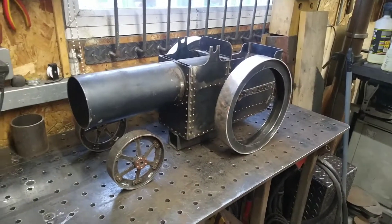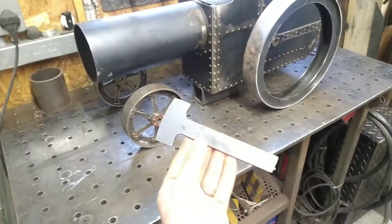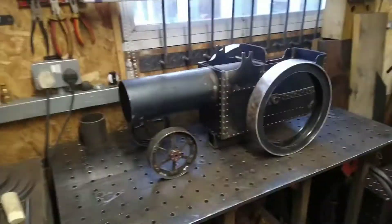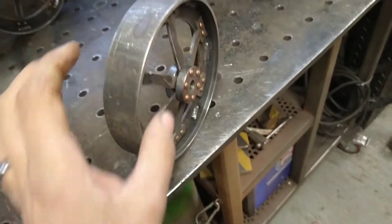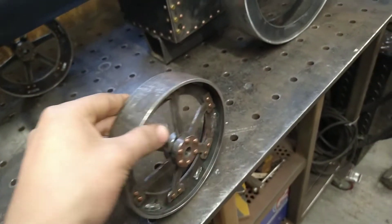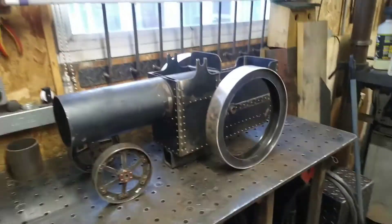That should look pretty cool when it's done. I'll try and keep the videos a bit more frequent if I can. The next job is to get these spokes profiled out — just to save a bit of time. Like I said I could do them like I did the front with these, but I've got a plasma now. I think it'd be easier just to have them as a fixed piece — two sets and then sandwich them together, like I've done here with the hub. Two separate pieces, profiled, back to back with the angles on them. And then it'll be three pieces of solid bar, just drill a hole all the way through, and press a bush in them. I think that'll actually work pretty well.